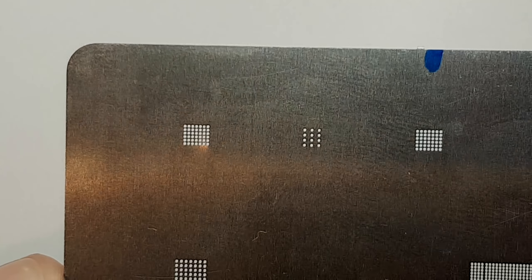So, because I knew that this part was a BGA, I had to find a stencil for it. What the stencil is, is a metal sheet cut with a laser — like this one. If you can see the individual holes, those are where the future balls for connecting the BGA to the PCB will sit. The reason for this technique is that the BGA has 35 pads that need to be connected to the PCB, and because there are so many, the balls have to be even so that every one gets connected to the PCB. At least, this is the idea in theory.